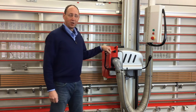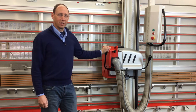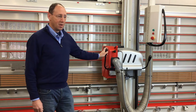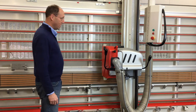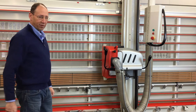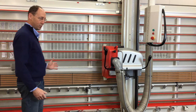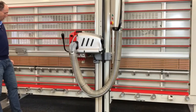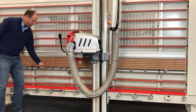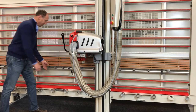The purpose of this video is to demonstrate the proper use and features of vertical panel saws, specifically a Stribig Compact Vertical Panel Saw. All Stribig Panel Saws cut both vertically and horizontally from one of two levels — either the main rollers on the bottom where the panel is full size, or from the mid shelf or center shelf on the saw when the panel gets cut down to a smaller size. Those are both standard features of every saw.